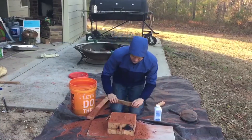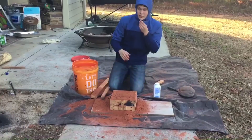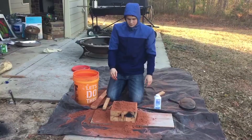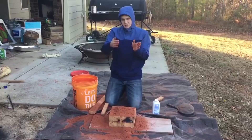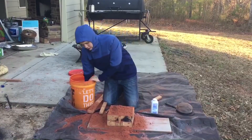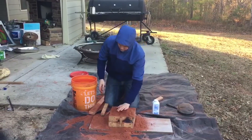I'm almost finished making this mold, and on the hammer, I think the reason it didn't work last time is because I didn't have any draft — it wasn't angled at all, just straight 90-degree angles. So when I tried to pull it up out of the sand, the sand stuck to it because it wasn't angled out, so it wouldn't come up. So I remodeled it and put those angles on it. Hopefully now it'll come out of the mold and work well.